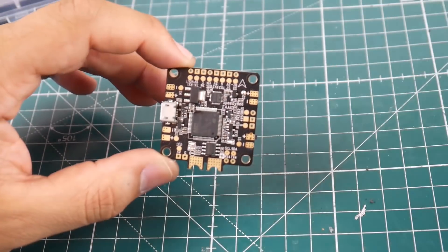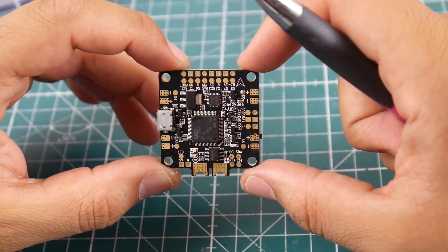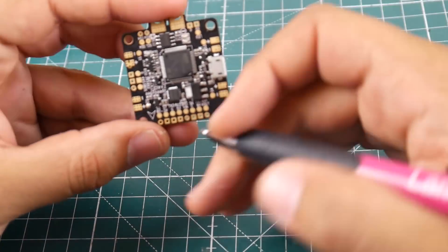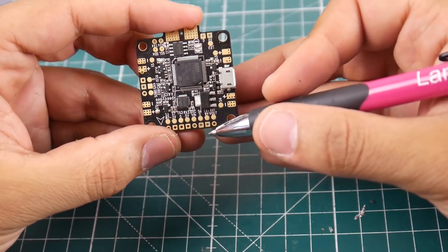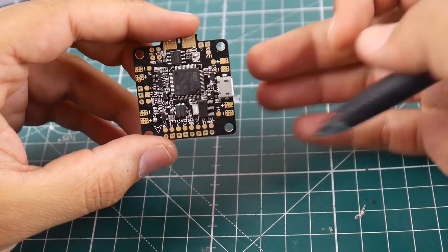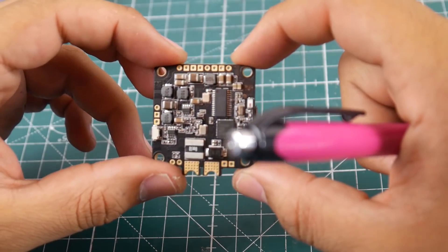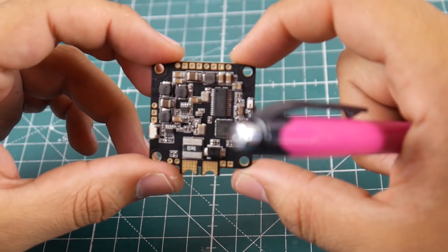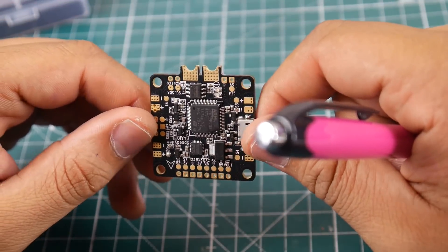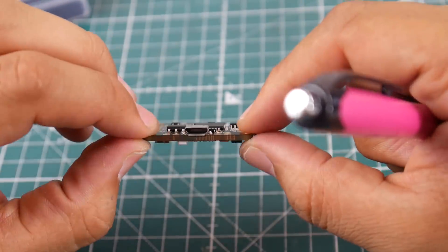So this is the one with the Bluetooth module built in and you can connect to it via the app — you just don't need your PC. What I didn't notice at first was this thing has — look, there it is — a nine-volt regulator for the VTX. My favorite. I think this one is a 3.3-volt regulator as well. Pretty nice filtration on board for a flight controller. I don't see a barometer anywhere, but that's totally fine.